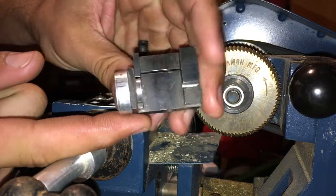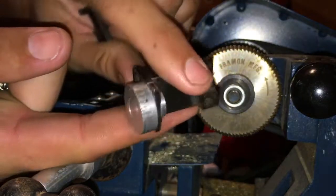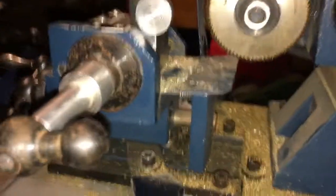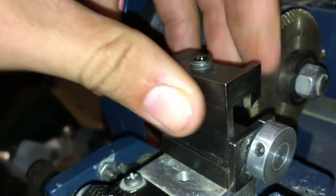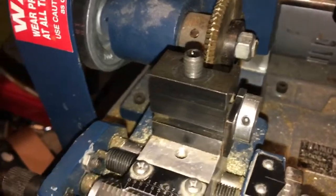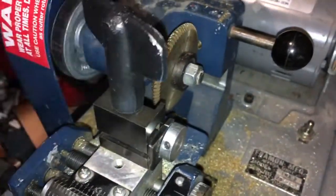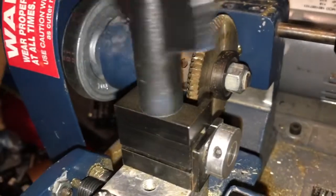This is the Tibbe jaw, the bottom part. Slide it on, put the springs in, the top part, get the springs to line up and find their home. There they are. Alright, you can see it has M and M on one side, so you know you're putting it together right. Reattach the wing nut. Now I always like to fully clamp it to ensure that it's seated properly. Okay.